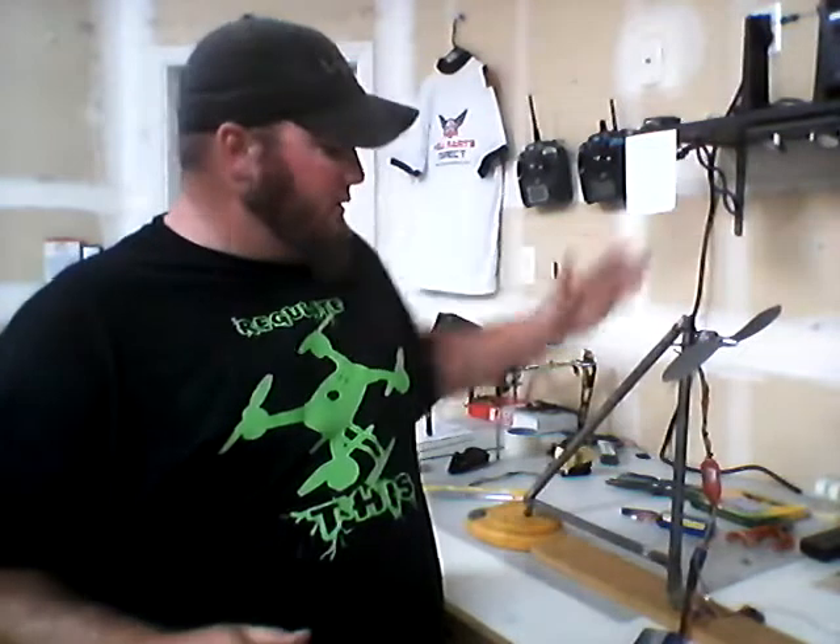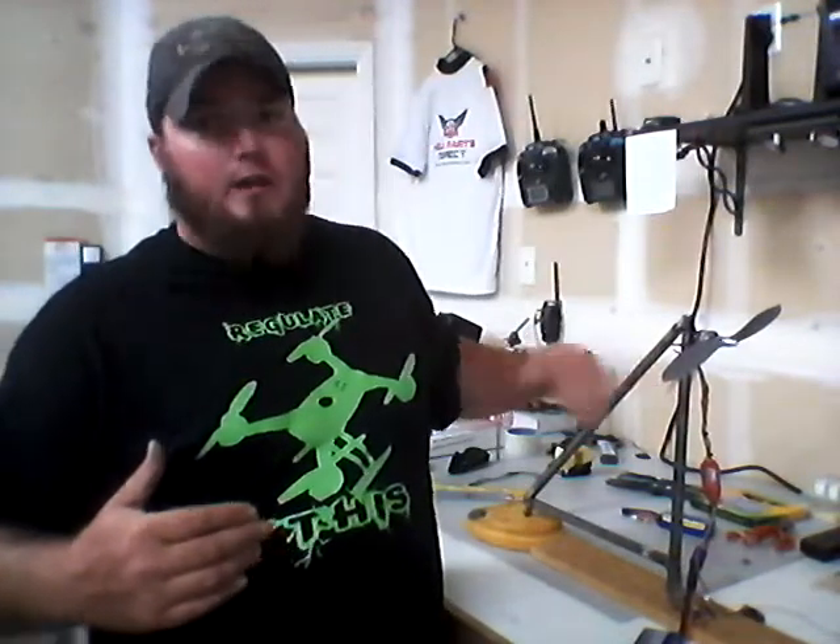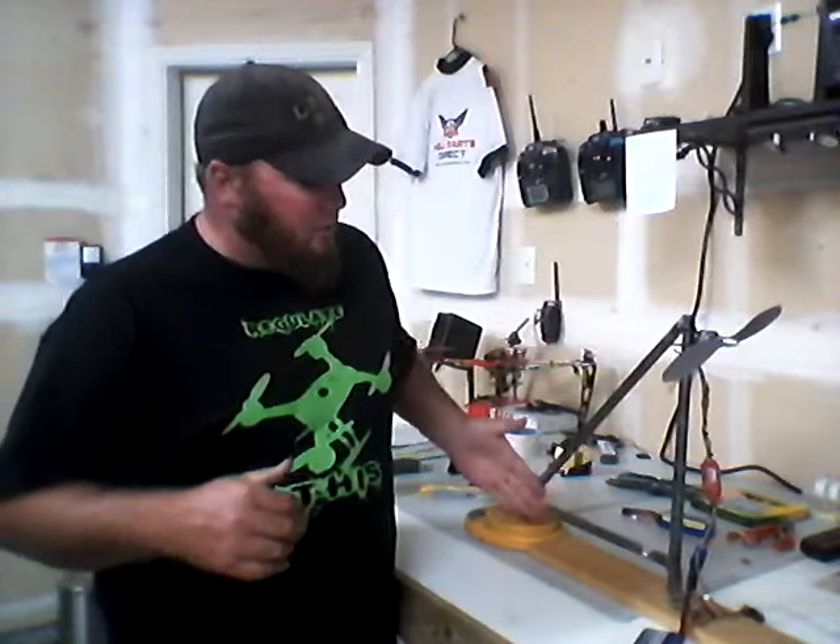If you had this side longer than the other side, you'd be transferring more force because of leverage. Or if you had it shorter over here, you'd be transferring less force. So you just want to make sure that they're equal and you have enough room for your props to spin. This support piece is just here so that one side doesn't bend while the other does nothing.